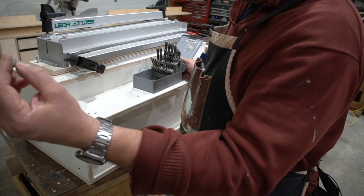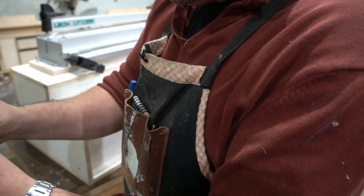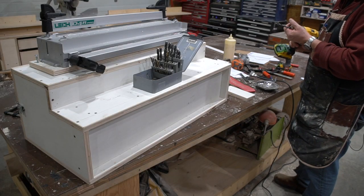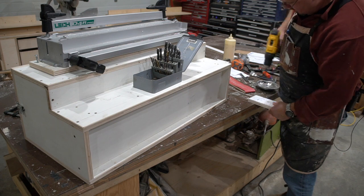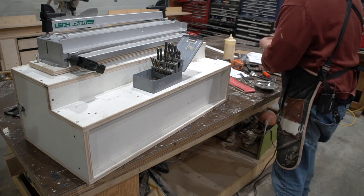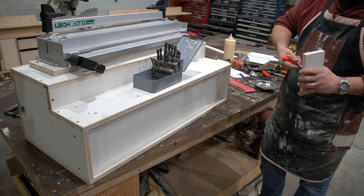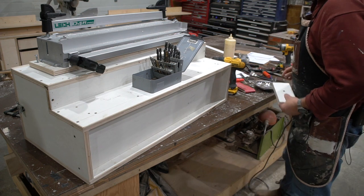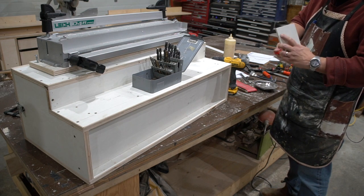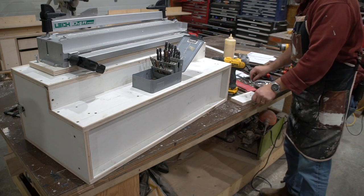This is a threaded insert. I drill a hole that is just smaller than the top of it — the whole thing is tapered but it's strong enough for the threads. Inside it's like a nut, tapped for a bolt. These have an allen head and you can get them at Home Depot. It's going in so easily. I'd say that's the right amount of friction — that's just a judgment call. I could probably go one size smaller because it came out too easily.